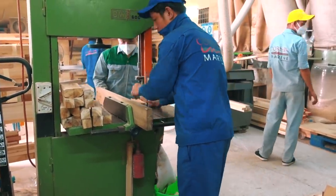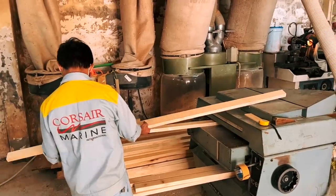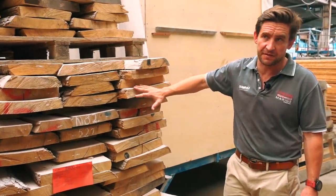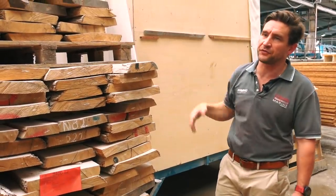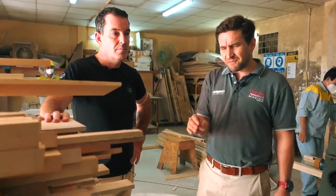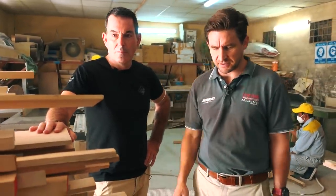This is the woodworking shop — everything is just winding down. The guys have stopped work for a few minutes to allow filming because there is a lot of noise in here. We've got a couple of different woodworking areas in our factory; this is the main wood shop. We bring in raw timber in rough-cut form, and the guys here are planing it down. We use a few different types of timber — sycamore, ash, poplar. This is the ash we'll be using on the 1370, and we've got some sycamore as well. We use a very small amount of teak, but that's becoming very hard to source so we're moving away from it — a combination of hardwoods and softwoods, typically from overseas.